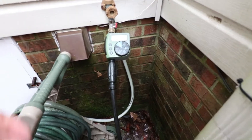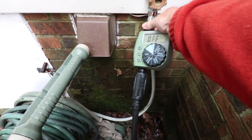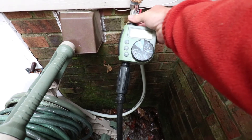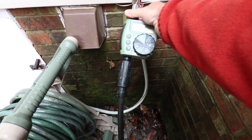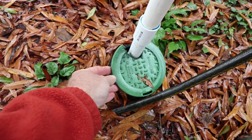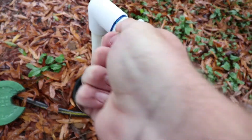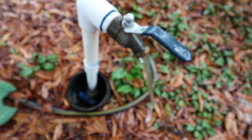The other things I'll do this week — I had a container vegetable garden over here on my deck and I had the irrigation running to it. I'm going to unplug it from the wall. I'm also going to disconnect the clock from the faucet. I'm going to disconnect anything from any faucets around my house. I've got an above-ground faucet in my front yard and I have a shutoff down below it. I'll shut it off, and then I actually open the faucet so whatever little bit of water is trapped up in there can have a place to expand.